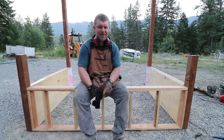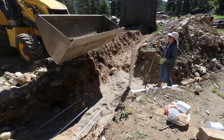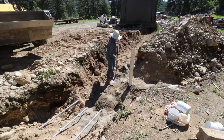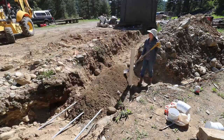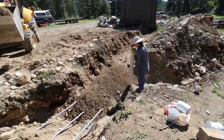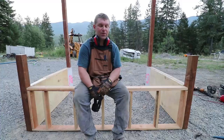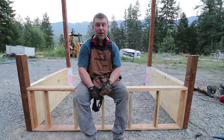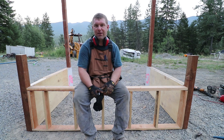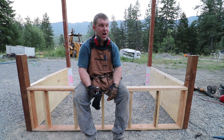But I have to say, and I meant to mention this about 5 times, this Grizzly has probably saved us over $1,000 in soil, because we have so much rock that the stuff we have here really isn't that great for strategic backfill. And since we're gonna be starting the excavation for the house very soon, we'd like to filter most of that soil. And that means that we should be able to reuse a lot of that for the fill after a lot of the footings and everything are dug and built. But without the Grizzly, we'd have to buy soil, which for us, a good load of soil is running about $180, including trucking.